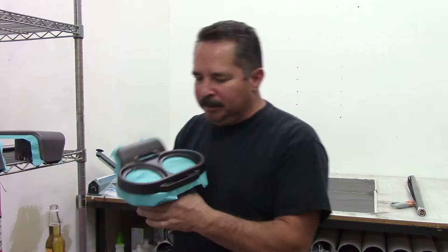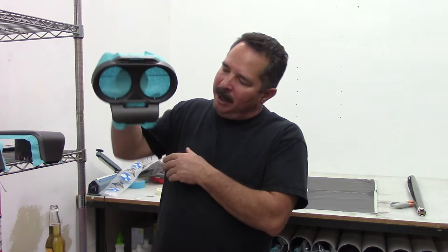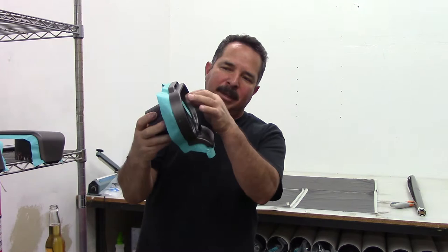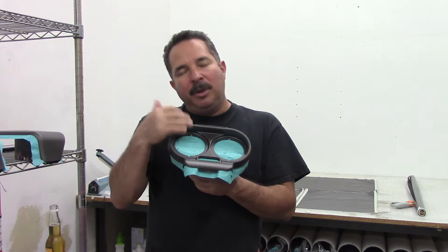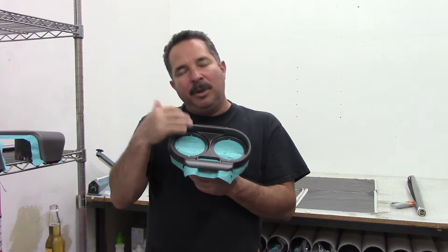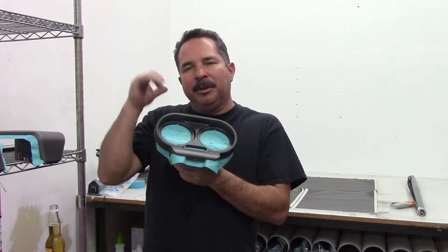This one, again, a gauge pod. You can dip it a couple different ways. You can come in and maybe slowly start to back feed so the pattern doesn't catch here and here, and eliminate your voids and stuff like that. The other thing that you're going to have to do is put a little razor cut to let some air out of the pattern as it goes in. That way you don't have a void. You keep the water from rushing in on the pattern or stretching the pattern. You've got a little razor cut letting the air out so you're not having a void. That's how we did this one.